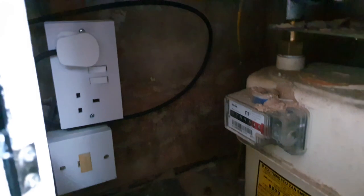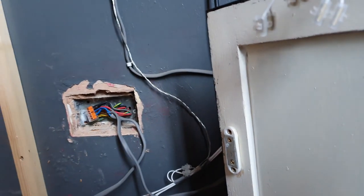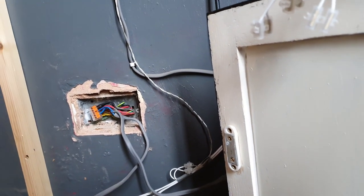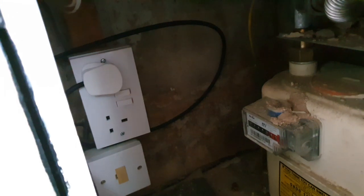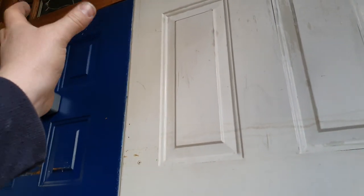Here's an interesting little insight: in this gas cupboard we've got a socket which runs off a little bird's nest that powers those sockets up there. This comes across into here and then that plug operates the lights on the front of the pub, which are on a light sensor and come on automatically. Then down the bottom we've got a fused spur which comes down here.